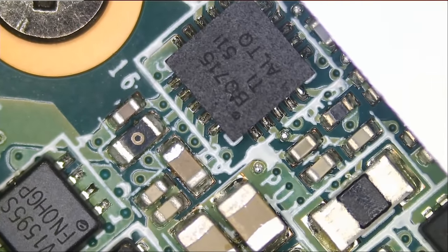I think I'm going to ask Big Boss to remove the board — I do not want to work on it while it's still inside the laptop and risk burning anything. Big Boss removed the board. Our short could be coming from either this chip or any one of those two MOSFETs. We do have a short on this cap but not anywhere else, so the short from this cap likely traces to this chip — if the cap itself is not shorting to ground. Based on my experience from the Samsung Galaxy S9 Plus repair, it's usually the chip rather than the cap, but let me start with the cap just in case.